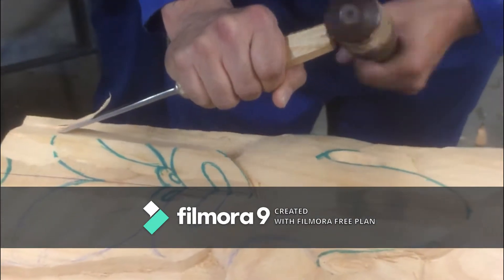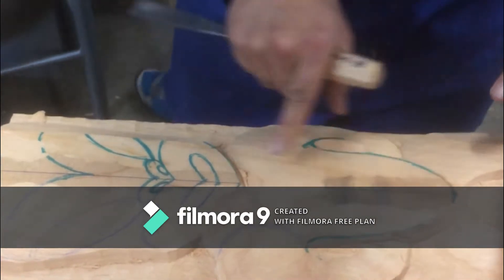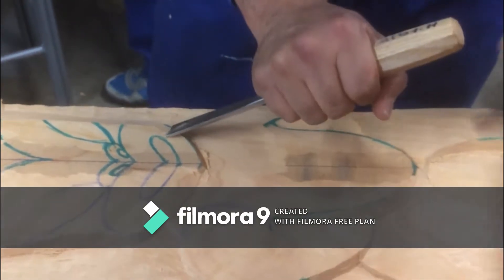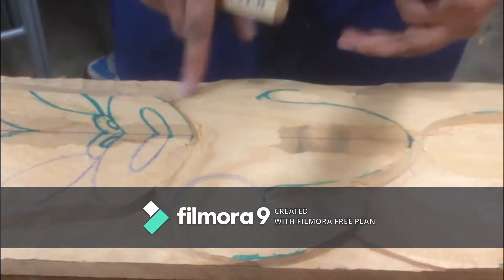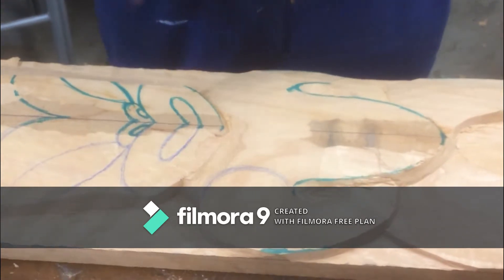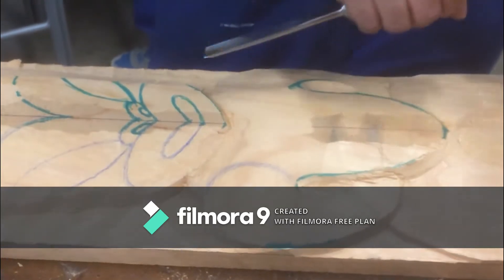When you're cutting across here, the same thing applies — as long as you keep this top corner out. Obviously, if it starts to split, then the grain's telling you to go this way. So we go that way. If you carry on, you do so at your own risk — you lose half your face while the wood's telling you you went the wrong way. Start again.